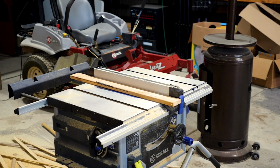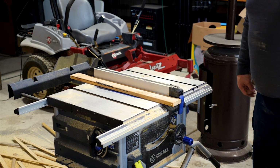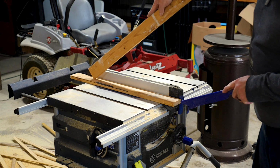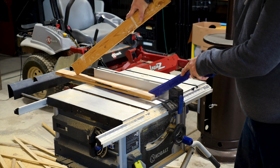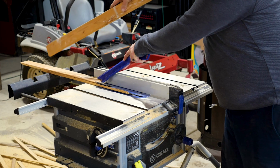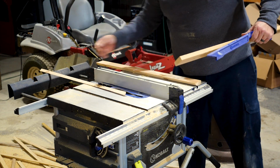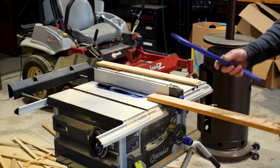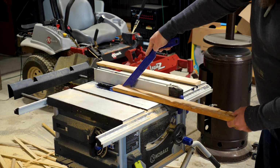I went back to my table saw and I was thinking how I wanted to hang this on the wall. So what I'm going to do is I'm actually going to make a French cleat. And what it is basically, it's a 45 on two boards, and the board that goes up against the wall, the 45 goes to it, and then it's opposite on your piece. And what it does is you just hang it right there, and it holds by friction because it falls into that groove.